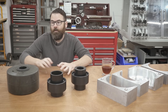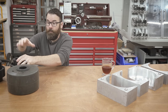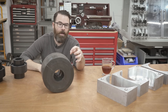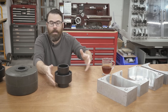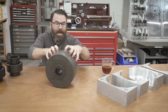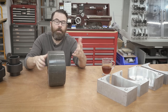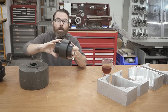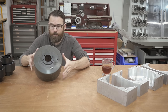I already have a whole video devoted to the wheels themselves on my channel, so I won't go into too many details. This is one of the wheels for Copperhead. It's 15 pounds give or take, made up of a polyurethane rubber outside and a nylon hub core. We pour the rubber around the hub, pop it out, and there you have your wheel. It runs on a dead shaft with needle bearings on each side, and there's a space for the sprocket that gets bolted onto it.